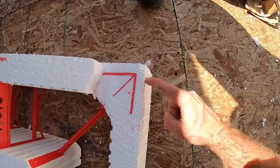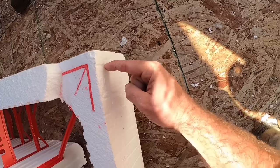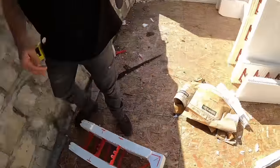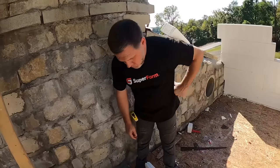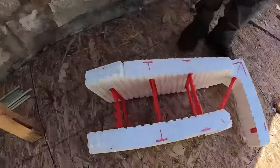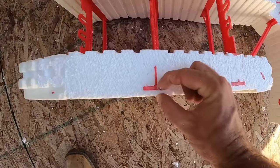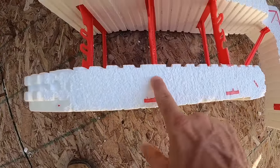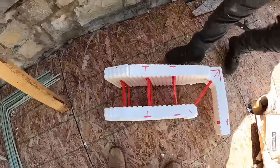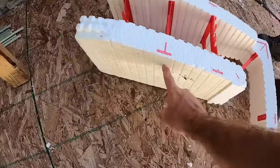So as long as you come over to this first line off the corner and put your screws from there to the other line, you're gonna hit this entire plastic corner for true strong attachment. This is also a good visual of a cross cut. Yes. So that's the stud we're talking about. You can see the distance of foam there. And then that's the webbing that connects to the other stud here. That's a great top image. Fasteners go right into it. You can screw into this.